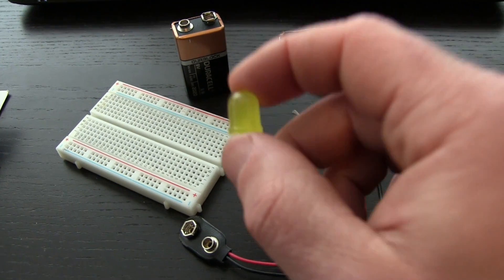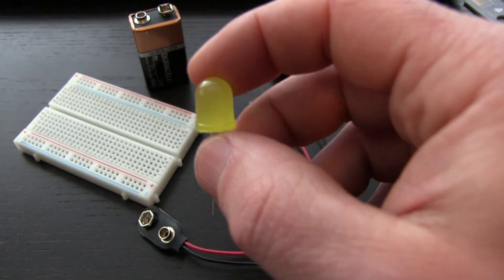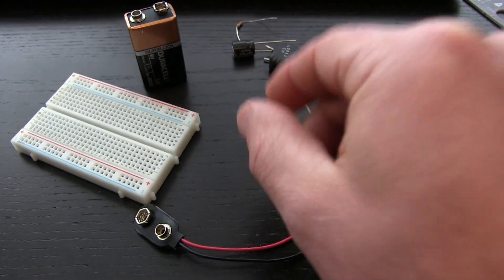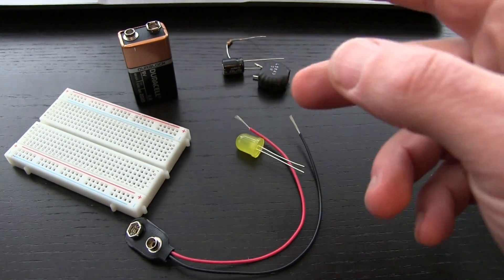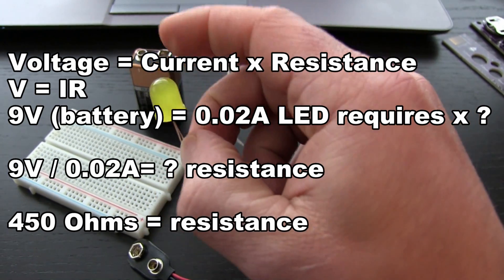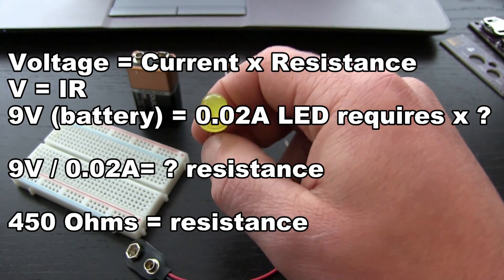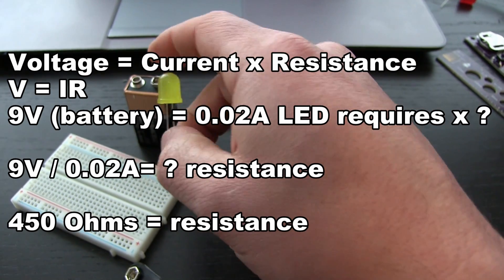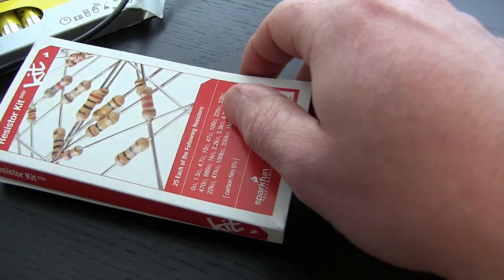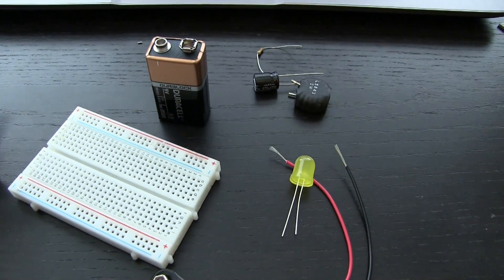Here's a new LED, and our first mission — knowing that if we just connect this up it'll blow up — is to get this to light and stay lit. What we need is a resistive element in there to reduce the amount of current going through. We're going to use a little bit of math: V equals IR — voltage equals current times resistance. This LED needs 20 milliamps, so 0.02 amps in order to operate. So 9 volts divided by 20 milliamps is 450 ohms. If we get a resistor from this kit that's 450 ohms, we'll be able to connect it to the battery without this blowing up.